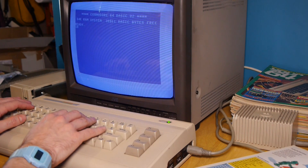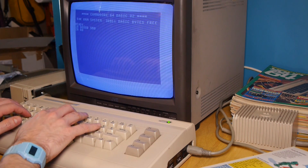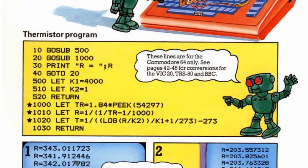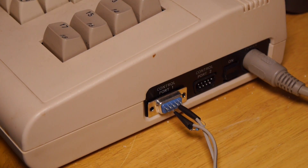This is where we remember how cumbersome the 64's keyboard feels for touch typing. How accustomed to luxury we have become. Line 10 calls the routine at line 500, which sets up some rough values for our integers k1 and k2. Line 520 then returns code execution to line 20, which calls the routine at line 1000. This is where the bulk of the work is done. That PEEK command is retrieving the output from our thermistor and passing it to the variable tr. Our job is to then convert this output into a temperature scale we're all familiar with — in this instance, that's degrees Celsius. With the program completed, we can plug our device into control port number 1 and hope for the best.